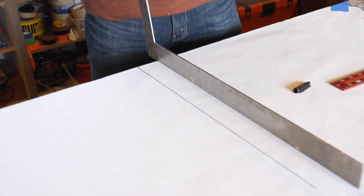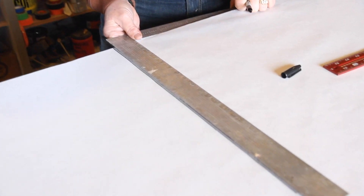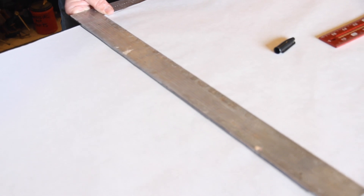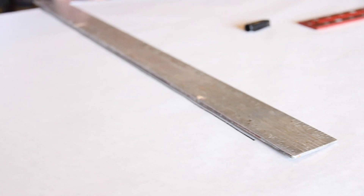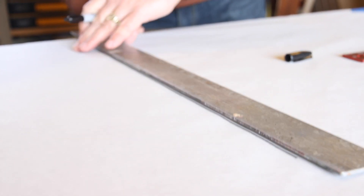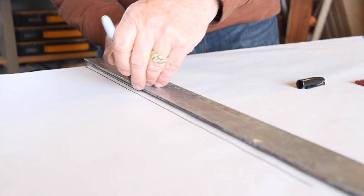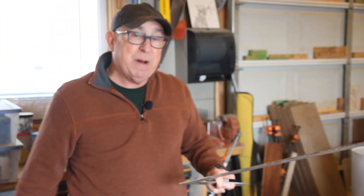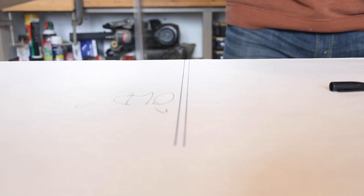So I've already done the first drawing. Now I'm going to roll this over and bring it back. I have a choice: I can visually look at it, and as you can see, that's pretty doggone good. I can either draw right over the top of it again, or I can separate the lines and draw between them, then look right down and ask: are those parallel? Well, those lines are. So this is our old square — and it checks out.